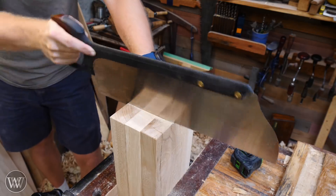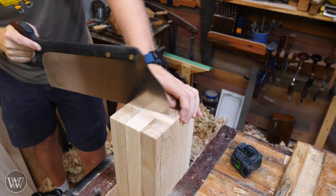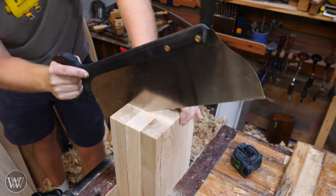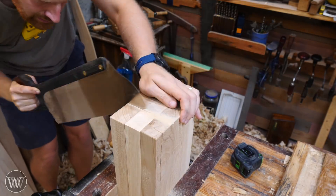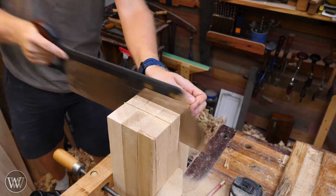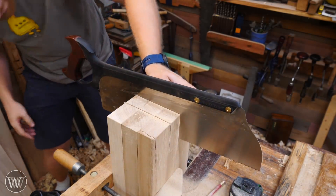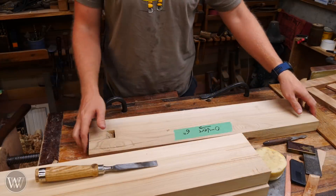For these I could have used a panel saw, which I probably should have, but I was comfortable with my tenon saw and it had a deep enough cut. These needed to go down three inches, so it was a fairly deep cut. Looking back, I probably should have used a panel saw with the larger teeth, but I'm okay with it — it just took a moment longer. A good bit of wax on the plate keeps everything moving, especially through such a large, meaty cut.